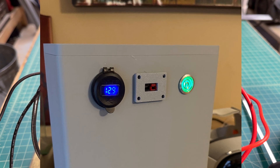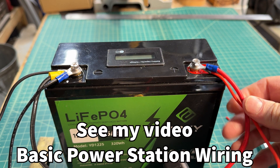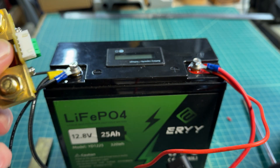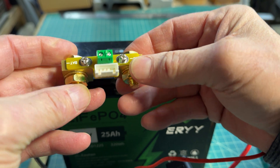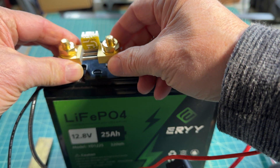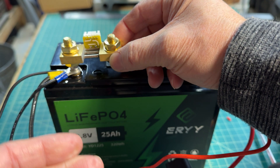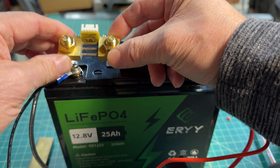In our previous setup for the basic battery box power wiring, we had our positive connections with one wire going to the power pole and USB charger, and three ground wires for those devices. The way the shunt will work — essentially it's designed to go onto the negative side of the battery, and in fact it's labeled 'battery negative.' We'll mount this to the battery and move the negative wires over to the load side of this, so any current supplied to the ports on the power station will be measured with this device.